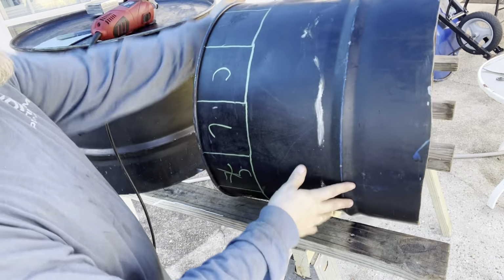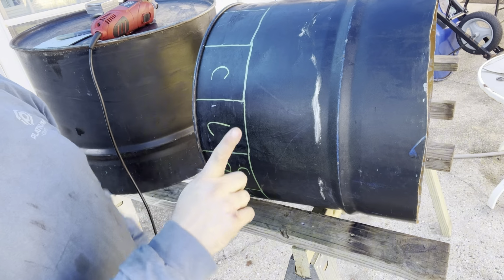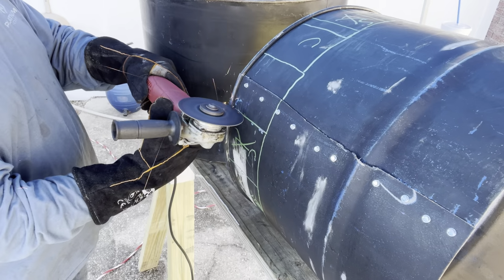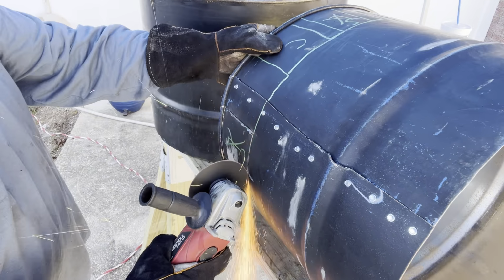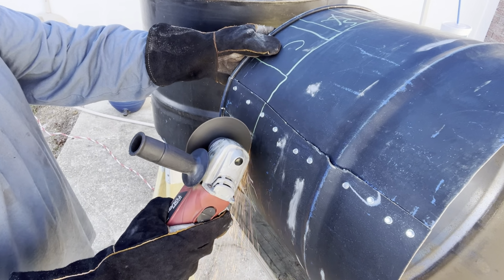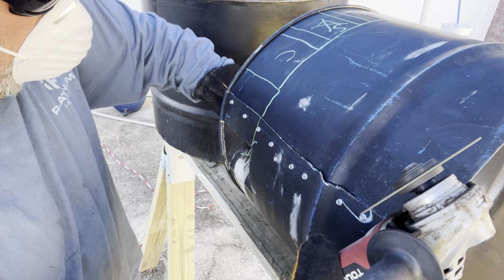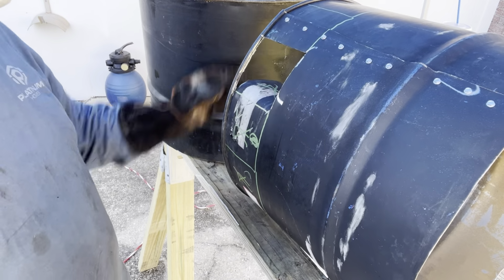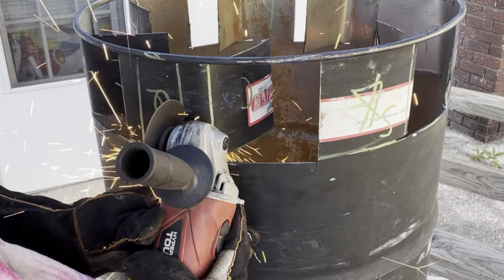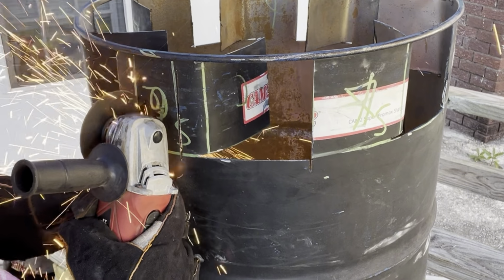And now you're going to cut these out to make vents, and you're going to cut the legs a different way to make the legs, and I'll show you right now. So cut along the bottom, one side, and the top of all of your cut squares, okay? You want to make sure you do it the same on every one of them so that you're bending it the same way. And you don't have to bend it in all the way, just bend it in enough. And on the legs, you're going to cut both sides and the top, leaving the section attached at the bottom lip.